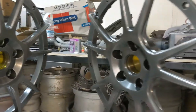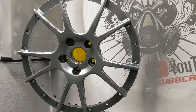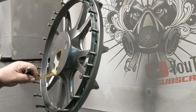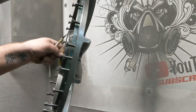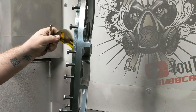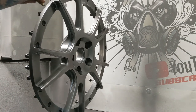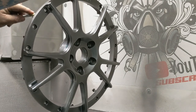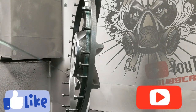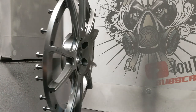Alright, got these things all done, fresh out of the oven. I'm gonna pull the tape off while it's still warm — definitely something I recommend. I see some debate about whether you should pull tape while it's still warm, but I've never waited till it cools down. The tape gets kind of brittle at that point and you have to sit and pick away at it, like pulling old stickers off a toolbox. While it's warm it stays nice and easy to get off. What I usually do is cut a single line into it where you can and just yank it off. Going to pull all these bolts out while they're still sort of warm.